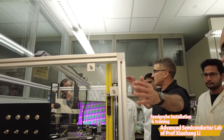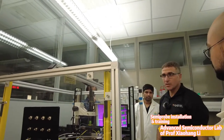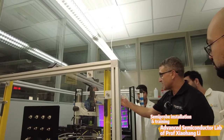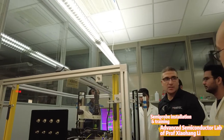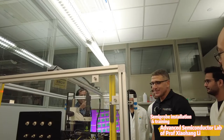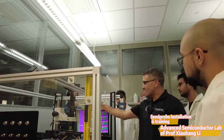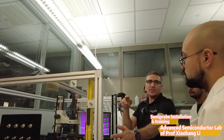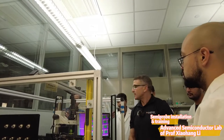We start with the shield — basically it's called a light curtain. There's light emitted from this device, it goes into this one, to this mirror, to that mirror, to that other mirror. If you twist this or the other one, the signal doesn't get through. This is the transmit, that's the receive. If the signal doesn't get there, you don't get these green lights. This is the sensitive part, so we should avoid touching any of this.